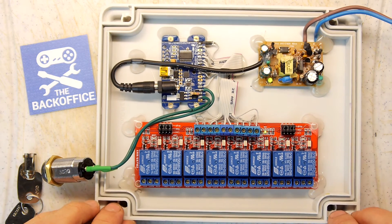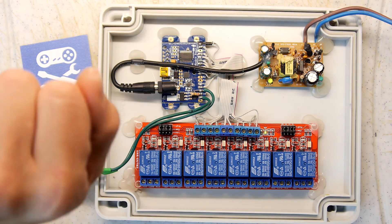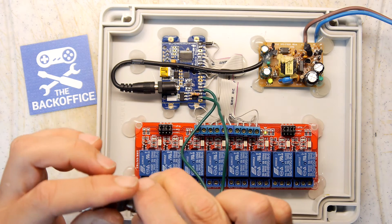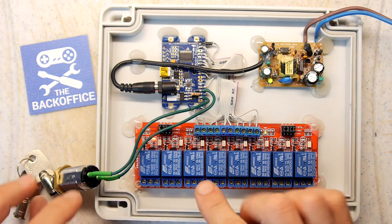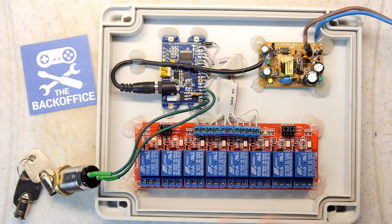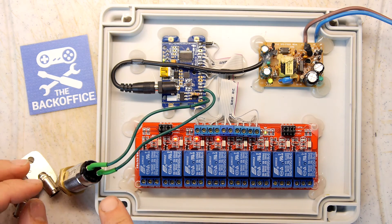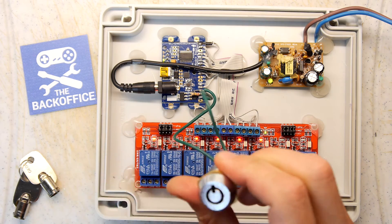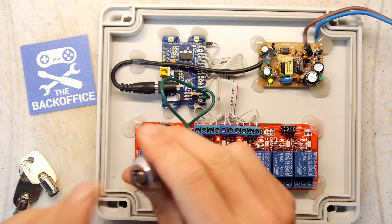If you turn the delays down you'll be able to see how it goes. This also means that if you had a latching switch, it would work fine — it wouldn't come on and then immediately start going off again because the key stays latched. You'd have to unlatch it to trigger the off cycle. There are loads of different switch types you might want to use. In the current firmware I haven't programmed up the USB — I might get onto that at some point. The current combination works as if you had a momentary button: hit it once and it goes through the on sequence, hit it again and it goes through the off sequence.